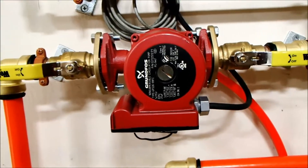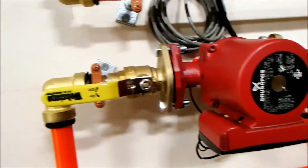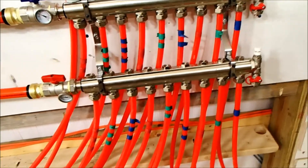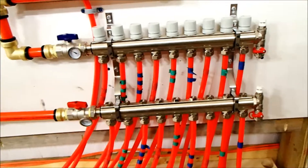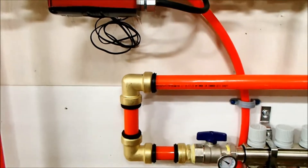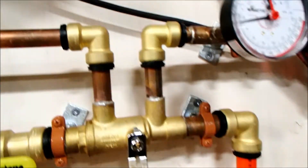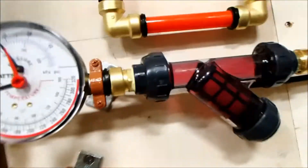I'm only doing one zone since it's all just to heat my shop, so I only have the one secondary pump. There's another ball valve, and then it goes down and enters the manifold — this is an RHT nine-loop manifold. I bought the PEX and manifold system from Blue Ridge Company; you buy it based on the size of your building. The bottom is where the water enters the floor, and it gets returned at the top — that's the blue connector there. Still using one-inch Watts fittings and PEX, which then goes back up into the other side of the purge T.